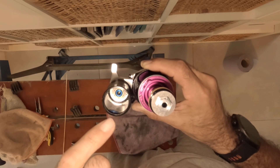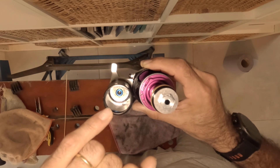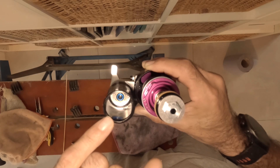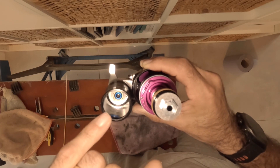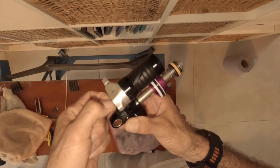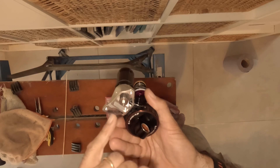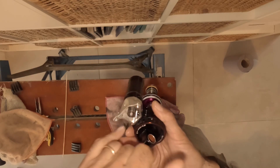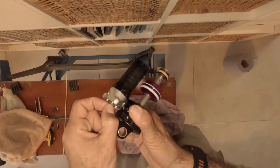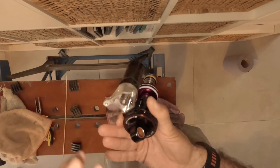So if you disassemble a Flight Attendant, never, ever disassemble this without remembering and precisely marking which shim and which component is on which place in the stack. Now it's all back together. I can turn this screw and now it's time to start reassembling. I'll have two things to look at: one is how this aligns — I'm not clear yet if this rotates all the way to the end or if it's just one small setting with a magnet. We'll see going forward.